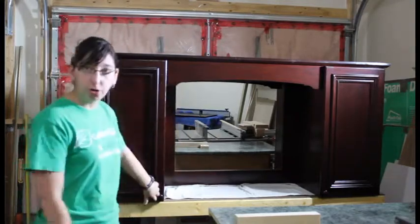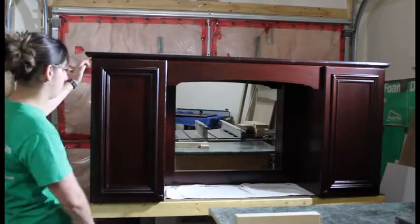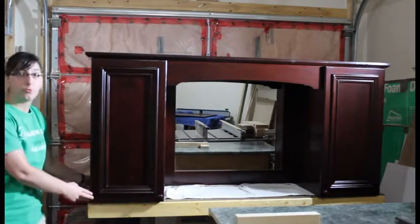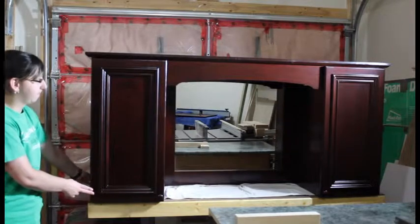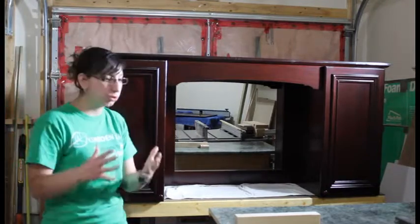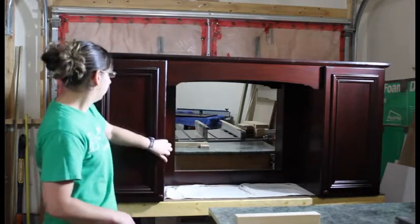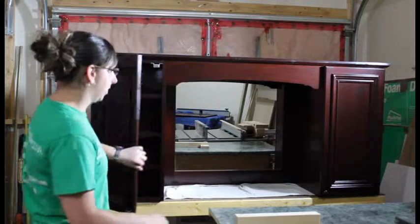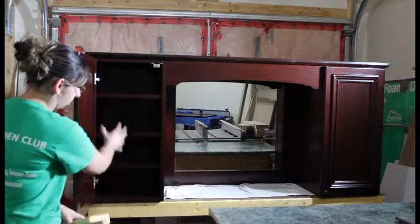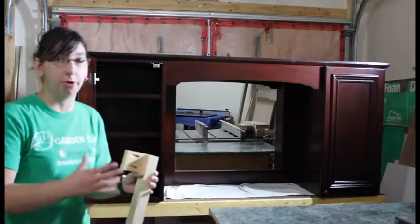And so basically what I had to start off with was the actual cabinets. The cabinets were 28 inches high, 14 inches deep, and 12 inches wide, which is sort of your basic kitchen cabinet size. And for the inside, I know you can sort of see it here, there are a few sets of shelves right now. But I used the Kreg Jig product, basically their pocket hole joinery.